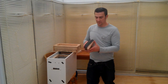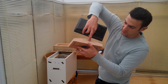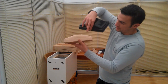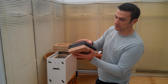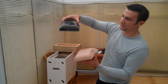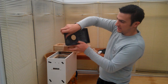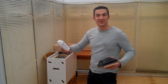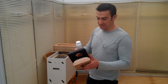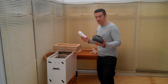This is another plastic casing mould, where again I've created small breather holes right in the tight corners to allow the plastic to take the form. That's one that came off it. As you can notice, everything's a bit powdery and dusty. I found that a really good release agent, funnily enough, is Johnson's Baby Powder — it's cheap, plentiful, doesn't damage the plastic or the mould, and really helps you remove the finished product.